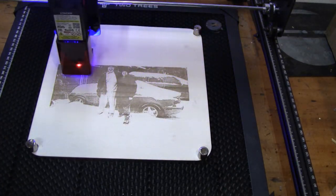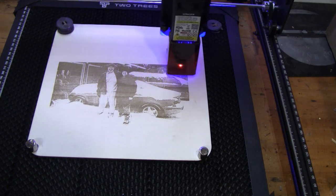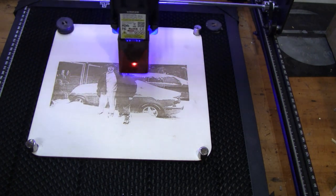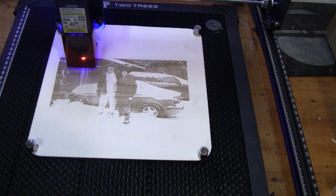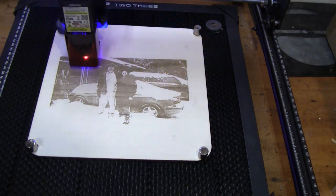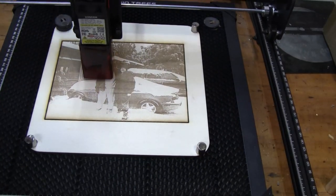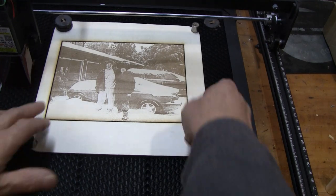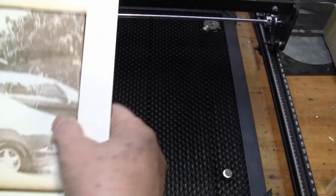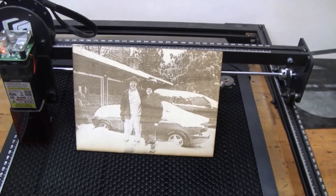While going through some old photos, I found this one. This was taken in 2008 when we got some really heavy snow, so we decided to go out and walk around in it for a couple minutes. But this photo helped me discover a setting that I don't think I had right. I let Lightburn discover the laser and I went with what it found, but I think it found the 5-watt laser because it was not getting full power. Once I discovered that, I could actually use the power I had it set on and run it twice as fast as what I'd been doing. So the time didn't come out exactly the way I was hoping on this, but the engraving came out pretty nice. I pointed this out because I think it's really important that your software matches what the machine is capable of doing.